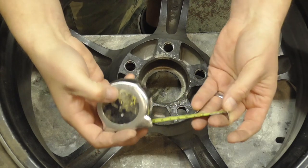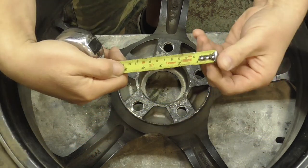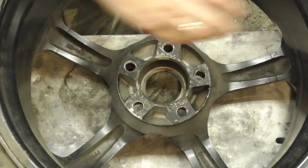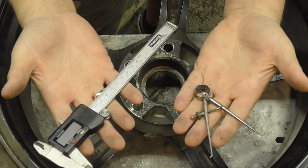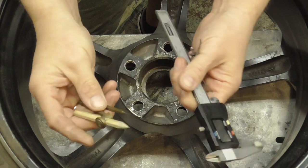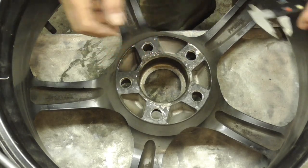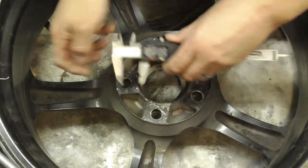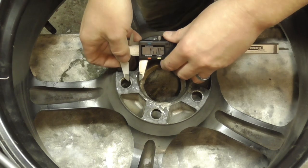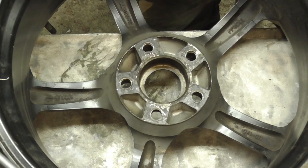Because I want to get this as accurate as possible I'm not going to be using my tape measure — I struggle to get accurate measurements using it, especially when it's as dirty as mine, and there's movement in the end and it's quite fat so it's sometimes hard to see. I'm fortunate to have a vernier gauge and some small calipers. Most people have these now — they're quite cheap. If you haven't got calipers you could use something like an old set of school compasses; all you want is two fixed points you can open and close and measure. So to avoid any guesswork we're going to measure from the inside of this lip to the outside of the bolt hole, then add that to the lip edge to the inside of the bolt hole, then measure across the centre. We'll add those three figures together and that should give us the PCD as accurately as possible.